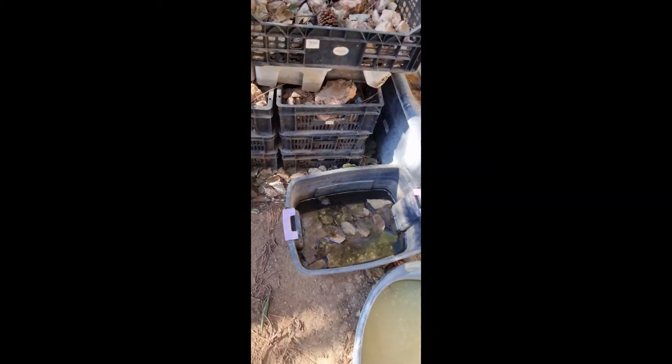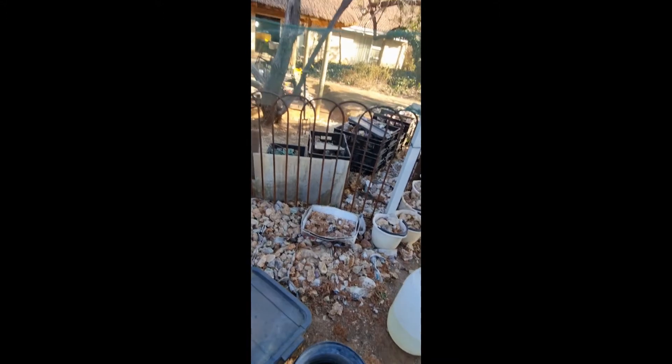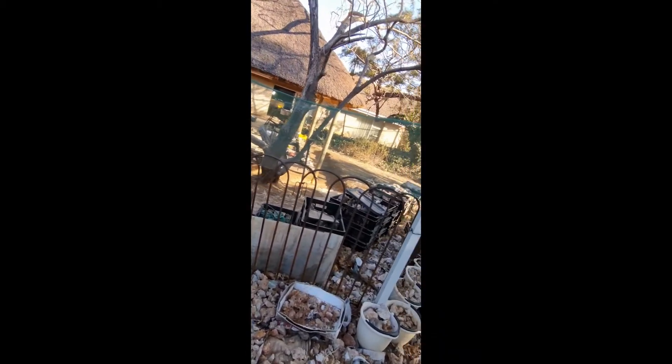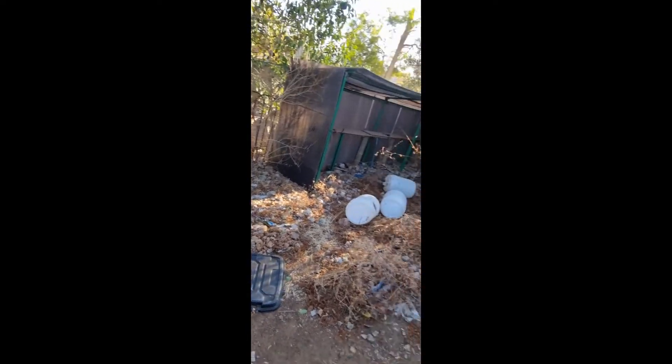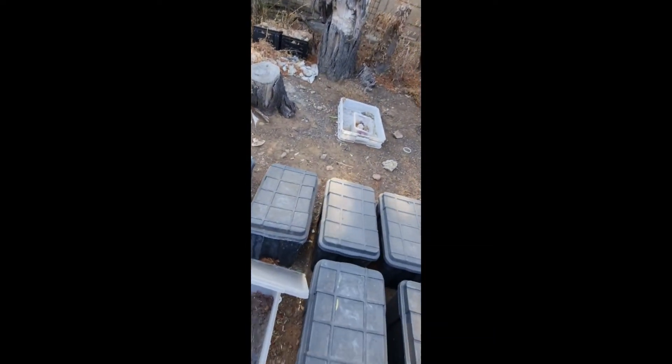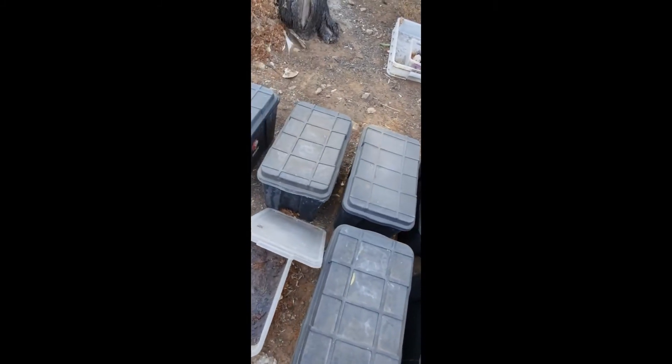For the harsher acids we use these sort of tubs. This is where I work with the hydrofluoric acid, which is absolutely vicious stuff — absolutely lethal, not so much because it's corrosive, but because it's highly toxic. We work in these tubs. I'm not going to be doing any of that today; we use it on the Zimbabwean fluorites.